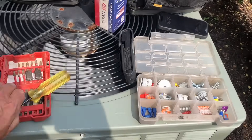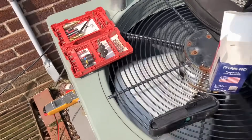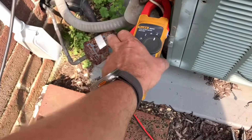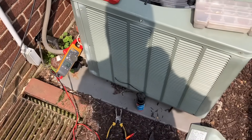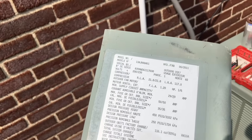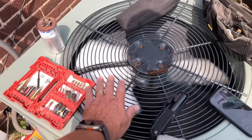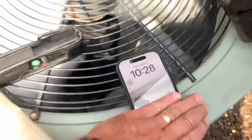The compressor doesn't sound too healthy. I'm going to move stuff off the top of the fan on the condensing unit. We are at 15.2 amps — let's check the other line: 15.3 amps, running without the hard start. This is a 48,000 BTU, four-ton, 410A system with a manufacturing date of June 2011. Hot air being discharged from the top of the condensing unit — getting it done on Friday the 13th!